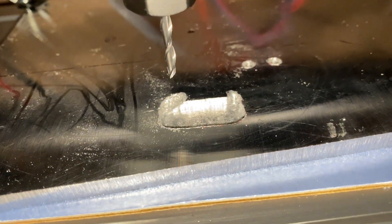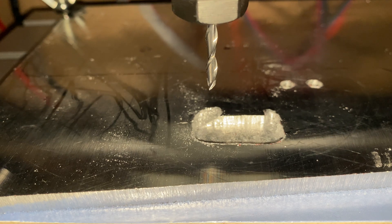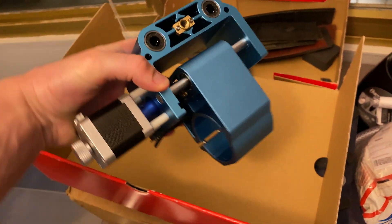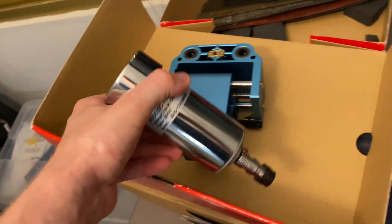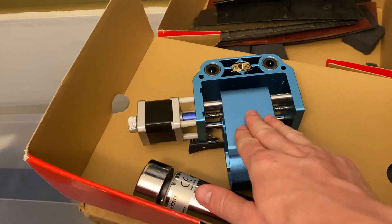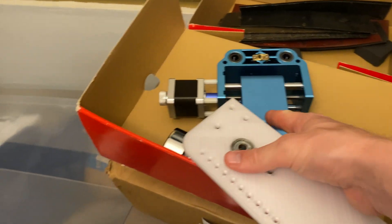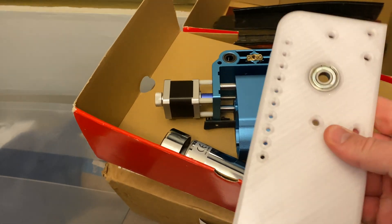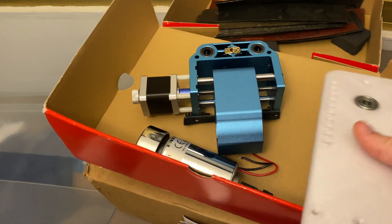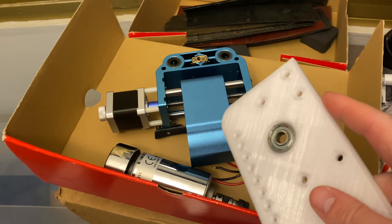Usually I love aluminum, but it's proving to be a bit difficult. I have no idea what happened here and there, so don't worry, I'll figure it out — it's a work in progress. This is one of the upgrades for the CNC spindle so that it can cut aluminum better. This would be the actual spindle and that's the Z stage that it would hold in. It's a very robust system. The CNC I have is only very slightly not adapted for this part, so we have to quickly adapt it to fit this new stage. This is 3D printed — it's PETG so it's pretty strong — and we'll use it one time because it's not going to last long cutting aluminum. Then we'll be able to use that with this, so hopefully that'll work.